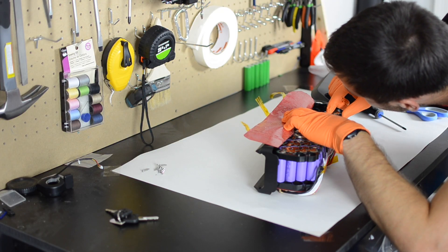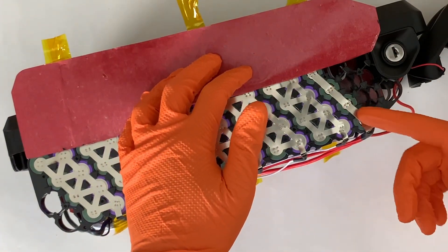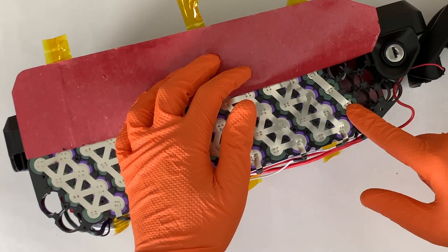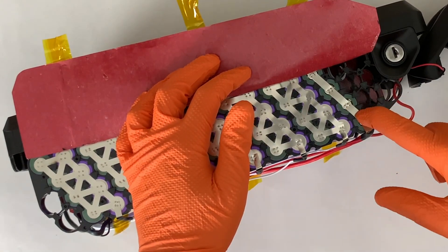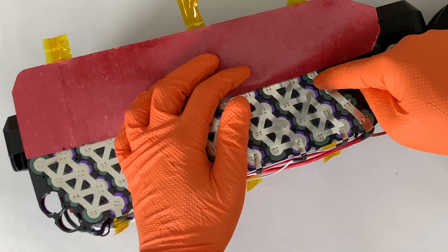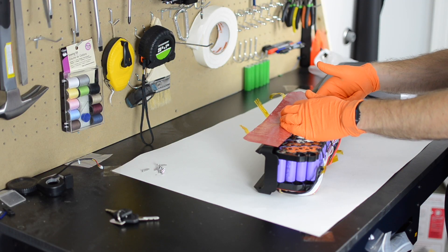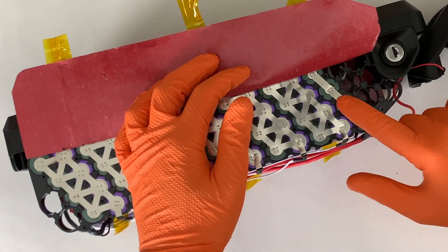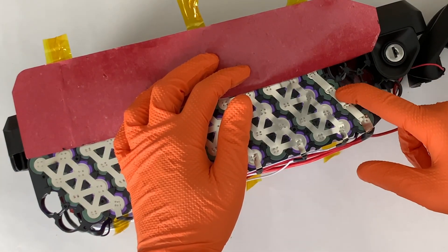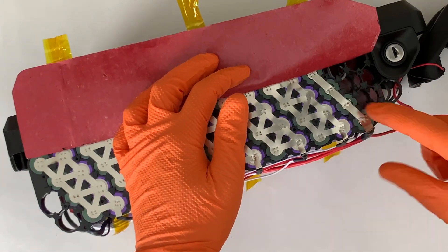I would have loved to have seen this distributed more. It does look like there are two levels of nickel here, so that is good — at least they didn't take the easy way out with just one row and put the discharge wire on the end. However, even with just two rows at 30 amps, I don't think that's going to be enough to maintain the power level without significant heating on this row. The last row, and specifically these last two cells, are going to get much hotter because all the power from the other cells has to flow through this same area before reaching the discharge wire. With what looks like either 0.1 or 0.15 millimeter nickel and only two layers, that's not ideal for a 30 amp battery. I would have loved to have seen thicker nickel here, or the discharge distributed across more connection points.